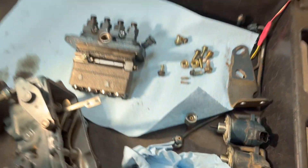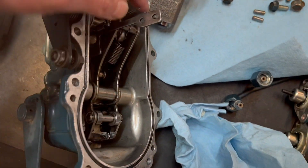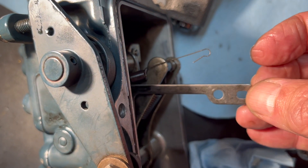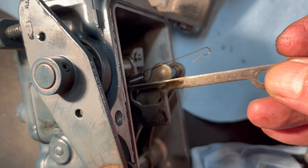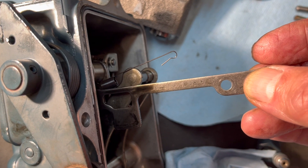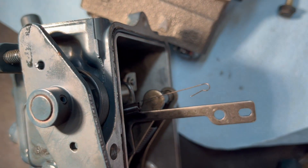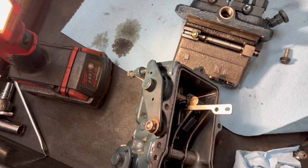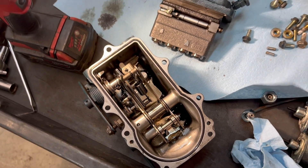Pretty sure we're also having another issue with this governor — probably a worn-out spring. This little spring wears out, and that's the only thing pulling this lever back to start the thing. When you shut it off, it pushes this way and the solenoid works against that spring. When you start it, that spring pulls it this way. It has to pull far enough to actually shut the thing off. So we're going to have this pump rebuilt and reuse this governor, and I think we'll be able to get it going on the other unit.